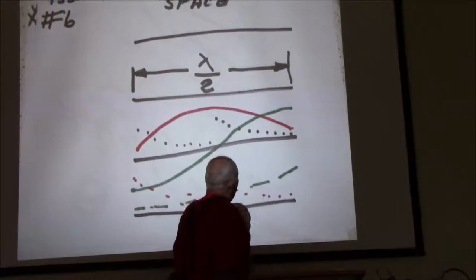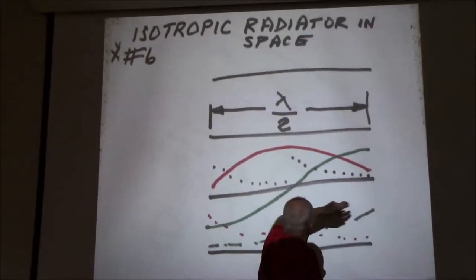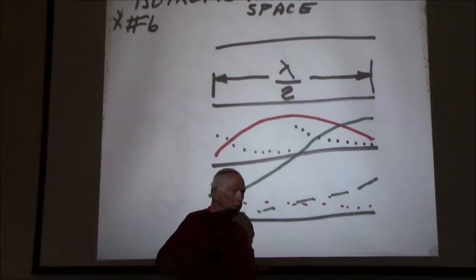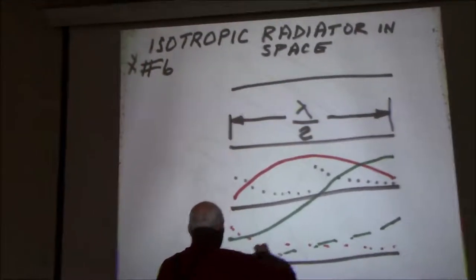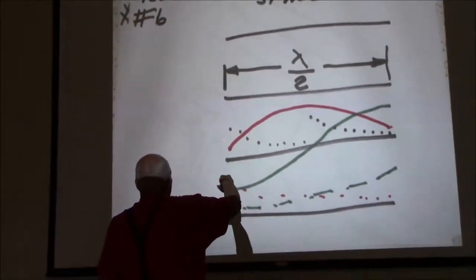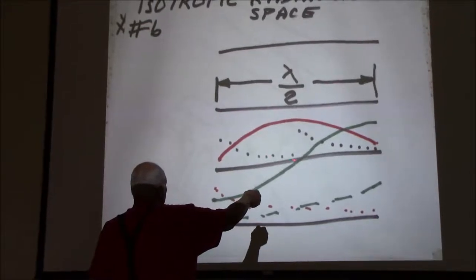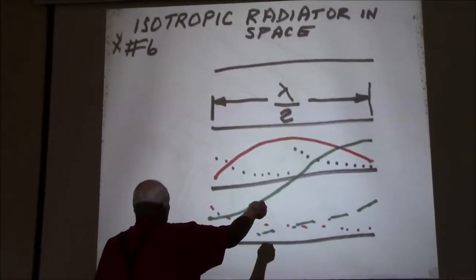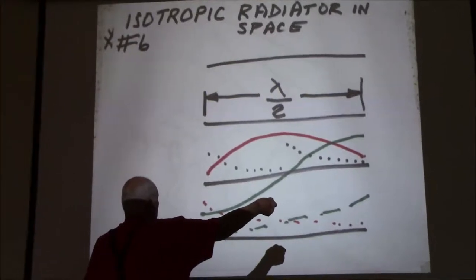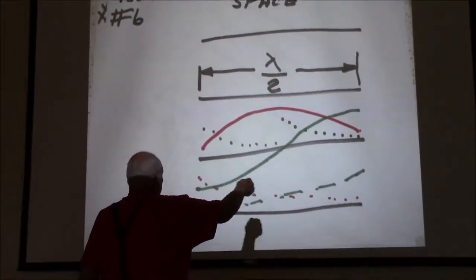And so when they all get down there, the polarity is going to change. It's going to be negative down here because all the electrons are here. Then it gets to be positive over here, and they all rush back to the other end. And they sit there, and they oscillate back and forth. Okay, now, the electron density is going to be highest on the ends. Negative pulls all the electrons to this end. There are a lot of electrons here, but by the center, there are almost none. The ones that were down here are able to move this far in half a cycle. But actually, it looks more like this. I'm just showing you, relatively speaking, where all those electrons have moved.